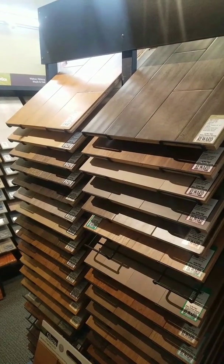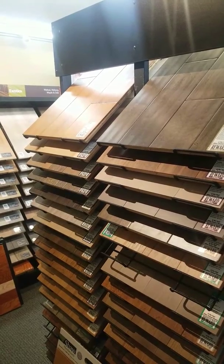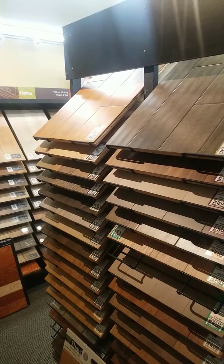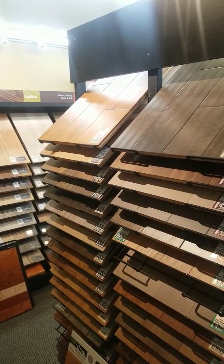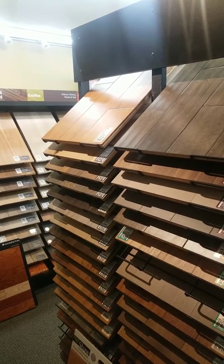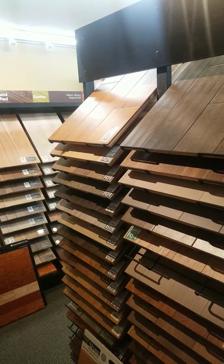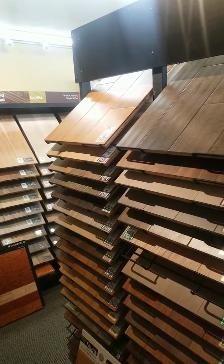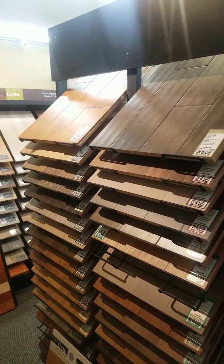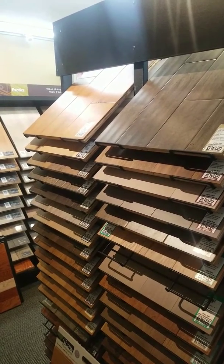Engineered wood is a great product. Some of it can be sanded and finished depending on the thickness of the veneer, although it's often very hard and expensive. Most of the time these products won't need to be sanded and finished, due to the perfect environment they're made in — a factory setting, not like in your home. The finish is harder and more perfected, using aluminum oxide. Some have titanium, some have Valspar — a few different degrees of difference depending on the product. Each product has its own top coats and anti-scratch properties. These are only anti-scratch, not scratch-proof. Anything you eat at, lay on, or sit at — you're going to want to put felt tabs on the bottom.